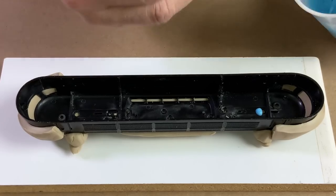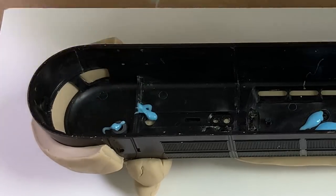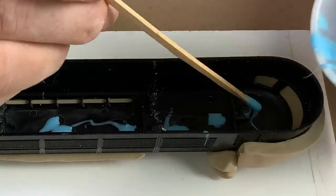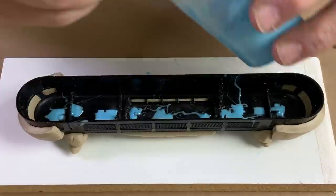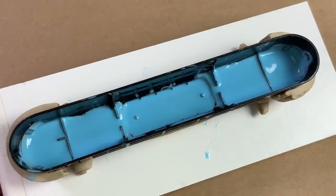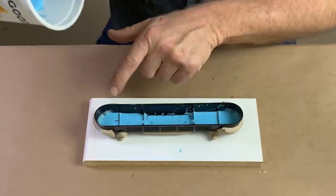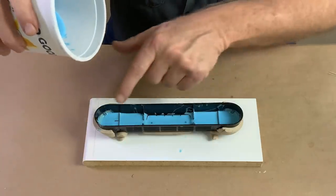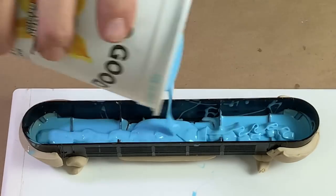The clay work is done. I mixed up a tiny amount of rubber and now we're just going to start dropping it in. I generally just put the rubber alongside the hole on one side, put a nice blob there, and hope that it will just run in from that side and fill the hole. This really is a craftsman's job, because the more time and care and energy you put into a mold, the more likely you are to get good castings out of it. All the holes are filled and we should have a good first layer. The first batch of rubber is all cured, and the reason I didn't fill this mold was I didn't want to put any pressure on those clay dams — I just put enough rubber in there just to seal everything up. This mold is going to have to be made in a series of pours; it's impossible to pour a mold like this in a single pour. This is not a one-piece cut mold — it's a two-part mold where the parting line runs all the way around the shape.